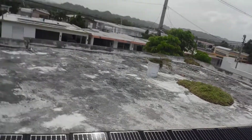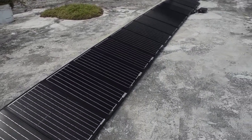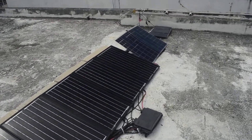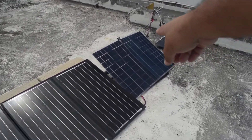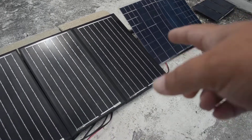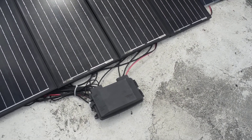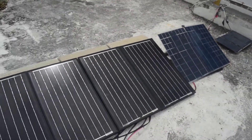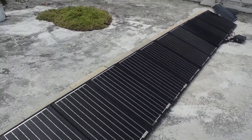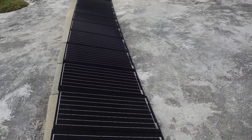You can see here my array — it consists of 16 thirty-watt solar panels purchased from Mighty Max Solar online. When I say 16, I'm not talking about those two over there — those are from China for a separate battery. I'm focusing on these black ones. Each of them is 30 watts and I have them all running into this DIY combiner box, all in parallel, totaling 480 watts at the moment.